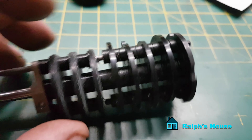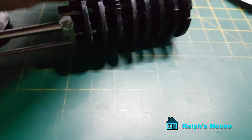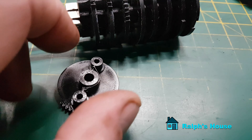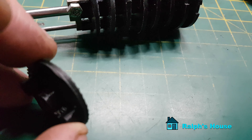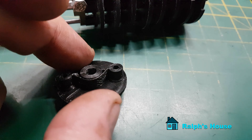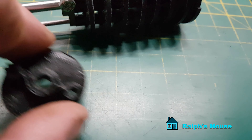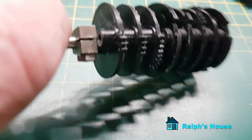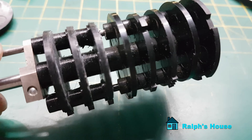The other reason you need this rod is that the end which bolts on has also got to locate squarely - that's all to do with the timing. There's also another one that goes on this end which is still sitting in the machine, part of the motor, so that everything lines up. So that's how I did it in the end - flat-bottomed - and a lot better for it. You do get a bit of flashing with a 3D printer, you can see that stuff around there - it's just the nature of the beast but it all cuts off easily with a craft knife.